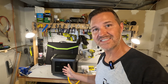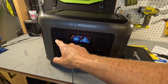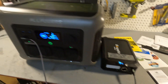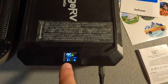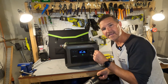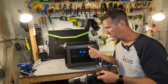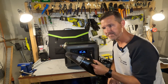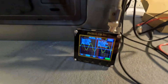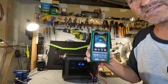Now let's plug some things in and see what kind of power we can get. I plugged a Bluetti device into the USB-C port and it is showing 104 watts output from this 100 watt port, though the receiving device shows only 91 watts input — still plenty fast. Next, the cigarette lighter port tested with a vacuum that pulls about 11 amps confirmed no problem at 10 amps at 12 volts. On the AC side, it is a pure sine wave output with an AC voltage of 121.4 volts, which is really good.